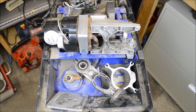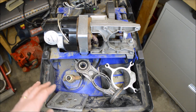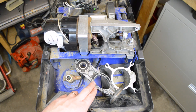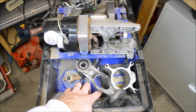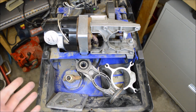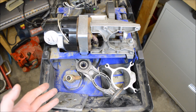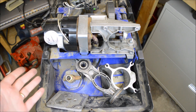So I'm basically right back where I was at the end of the last video — should I fix this or should I replace it? At the minimum I would be looking at $65 plus shipping for a piston and cylinder kit, and that's assuming I can reuse my original head gaskets. I feel like that may not be worth it because who knows how long the motor will last, especially since it will be working harder once compression is back to normal. I'm going to keep thinking about it and I'll let you guys know what I decide. Hit the like button, please subscribe, and thanks for watching.